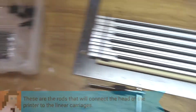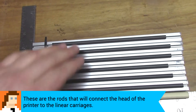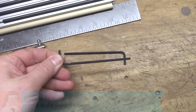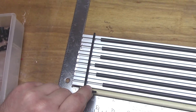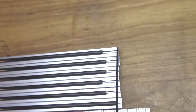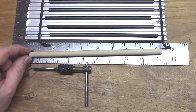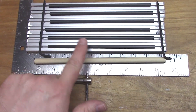Here's everything we need to get the diagonal rods put together. We have the aluminum extrusion that we cut last week, the six graphite rods cut to length, two of these M2.5 or 2.5 millimeter hex keys that are long enough to go between all of them. We'll put these on both ends through the ball joints when it's all glued to keep them even. We have a wooden dowel cut to 224 millimeters, which is the same length as these rods with the ends on them.